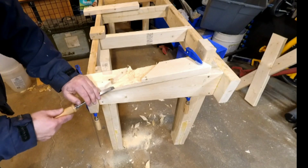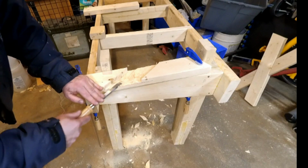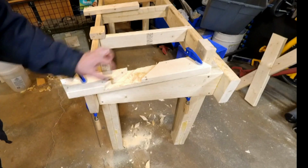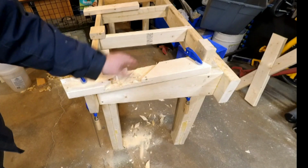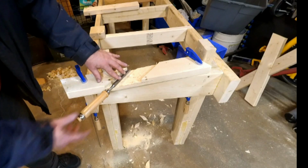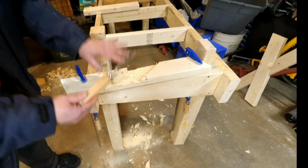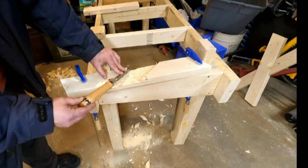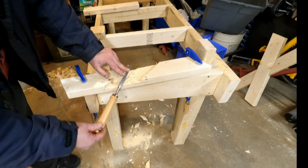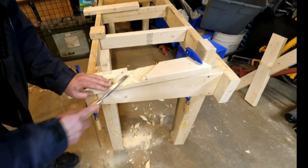And we're going to go here. Just dig a little of this end out. And once you're getting close, like this section here, the edges of your chisel are parallel to each other, so you can use it as a tool to measure across like this. If you lay it into your slot and it sits like this, you get a hump on this end. Sits like this, hump on the other end. If it rocks in the middle really bad, hump in the middle. So you can read it with your chisel like that.